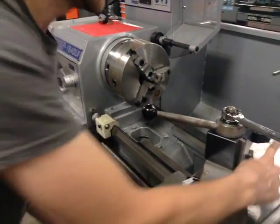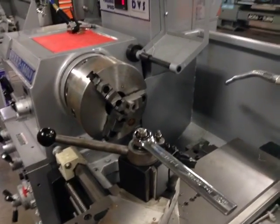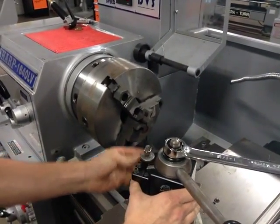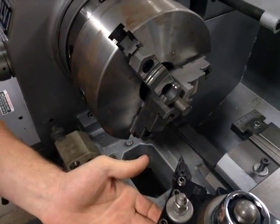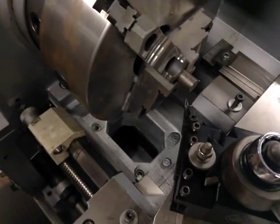So of course, this being the cutting edge has got to be in a direction so we can cut that material. We're going to turn this and have it angled so our cutting edge is almost to what you could say a square or 90-degree angle. Something like that. We'll come up on it. You can see kind of the direction of our tool angle.